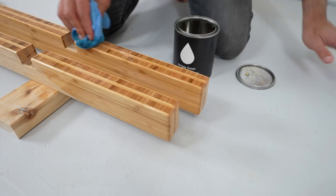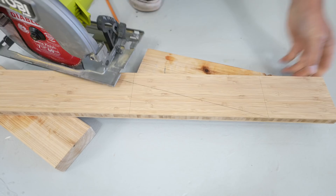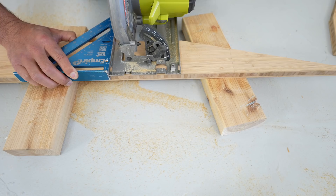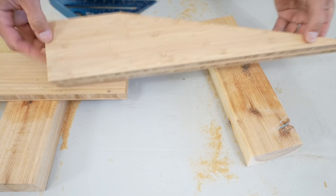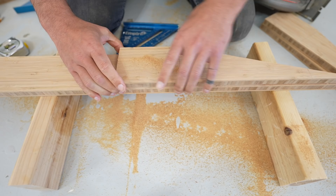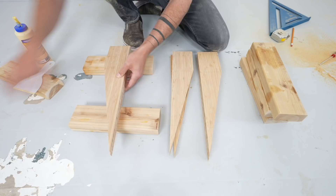The back rest is supported by some angled pieces. In the plans you'll see the measurements but don't worry, this is really easy to do. I just draw out the lines, draw a diagonal, and then just cut along that line with my circular saw. You can also use a jigsaw if you're a little bit more accurate with that. I didn't cut the pieces perfectly but that's okay — I'll still have a chance to even them up during the sanding process plus I'm going to trim the ends. These three angled back supports are also going to be two layers of plywood thick, so I just glued them up and clamped them with some more of the spring clamps.